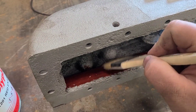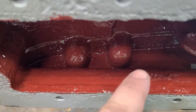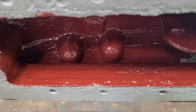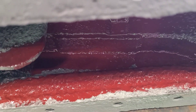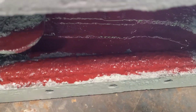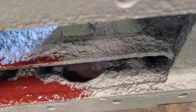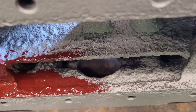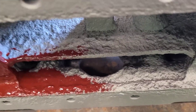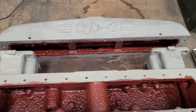You can see I kind of have it pooled up in there — notice it's covering everything. You come down here, that's what you can reach with a brush. I'll do the same thing down here, pull that in there, rock it back and forth, and then the excess can all run out of that hole. I'll just rock it back and forth with a rag underneath that hole to catch the excess.